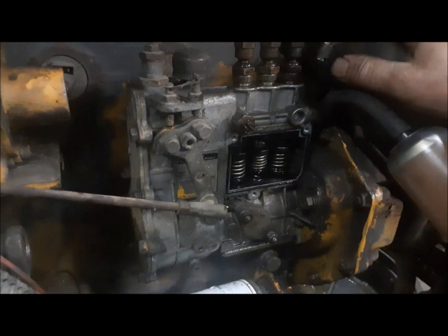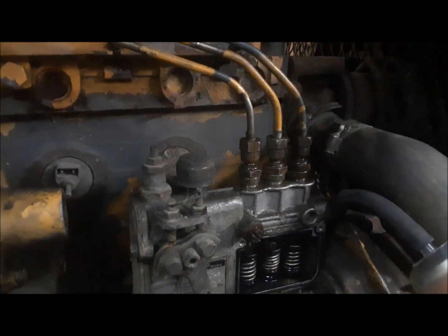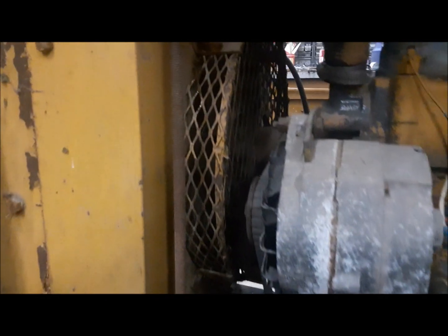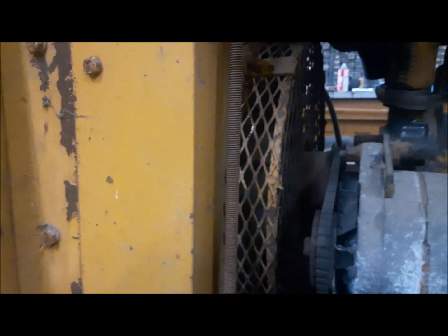And then I got it, it was really steaming. I don't know if it was because there's no water in it and it was boiling what's in the block, or it's quite possible there could be an internal engine problem that's pressurizing the cooling system. I'm not too sure about that. We're going to get at this radiator here and see what we can do with it. I've got an old 4-core rad around here somewhere out of an old Dodge truck. If we have to, we'll use that. We'll figure that out one step at a time. But we're gaining on it.